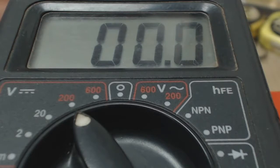Hello everybody. We're testing a 240V supply through a dimmer switch to a 12V battery charger. We're going to test for DC voltage, we're also going to hear the sound of the battery charger and the buzzing, and then we're going to run a 40W lamp in parallel to reduce the effect. You'll have to turn the volume right up if you're going to hear this.